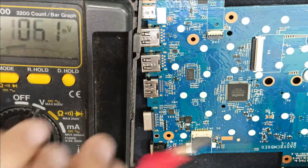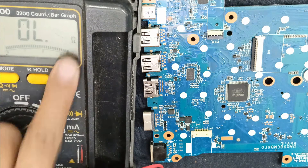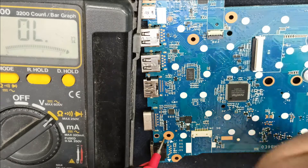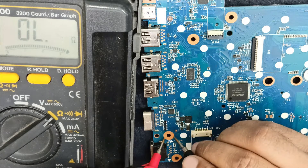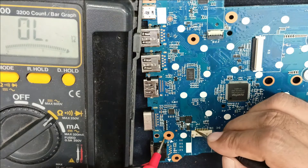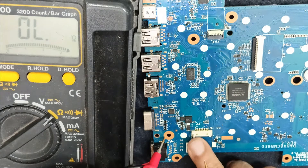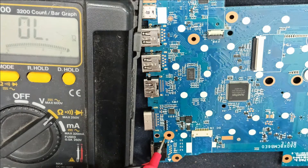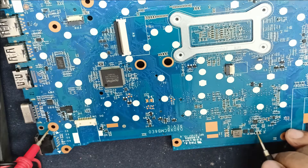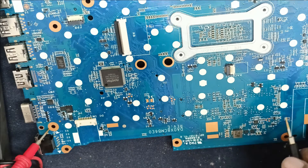Here is an easy technique to find a short circuit. First of all, set the multimeter to ohms direction and select continuity mode. Keep the negative lead at the ground position, then check all connectivity — when you get a short circuit, it will automatically beep. This is the best way to find a short circuit. I will check all the capacitors. This is the ground connection from this power socket jack — here there are many capacitors to check. This is the ground and this one is positive. We need to find where positive and ground are shorted, but here there is nothing so far.